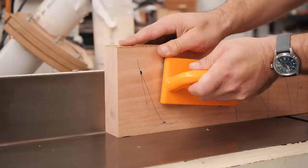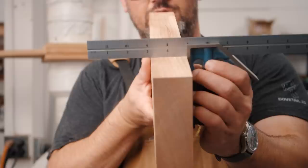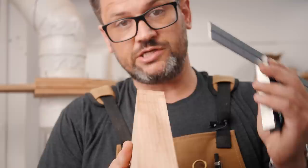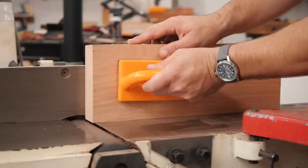To check this one, you take it and run your square along the edge. I can see I'm slightly seeing some sunlight on this side — the left-hand side of your screen. The reason is because of that big angle that was on that board — we didn't quite get it all. So this would be something we would need to run two passes to get completely square, but we would do so with no issue.